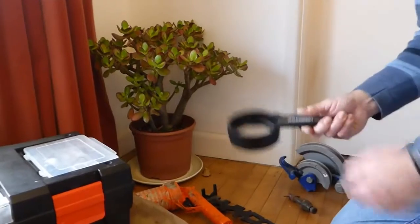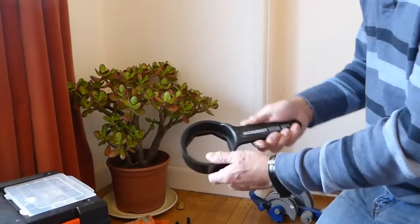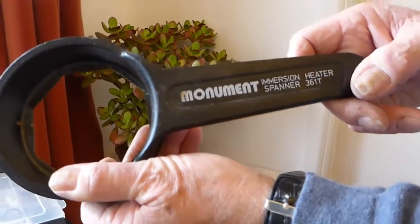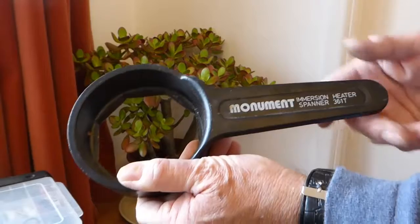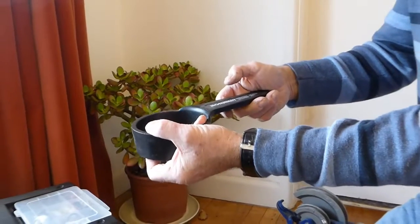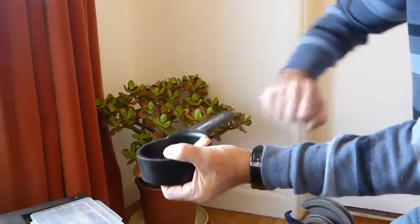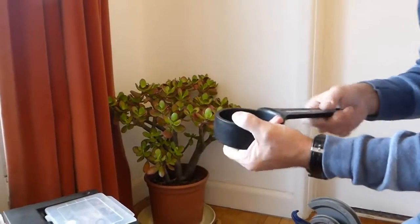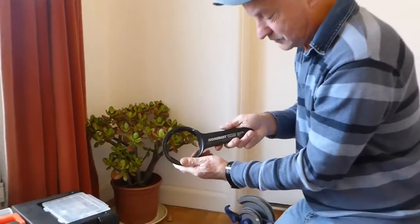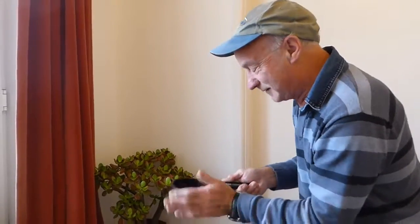Last but not least — this. If you're doing immersion heaters, if you do a lot of immersions, this is the one tool for getting them out. It's a Monument immersion heater spanner. If you want to get immersions out, this is the boy. You see it's not long, but the way it's built it's heavily built — you put this on the immersion and you shock it by hitting it with a hammer, hit the handle with a hammer like this, and it shocks the immersion and undoes it. I don't think any other tool can get them out — try Stilsons and you could rip the top of the cylinder off. This is the tool if you're doing immersion heaters. I've used it for years — well, the last forty.